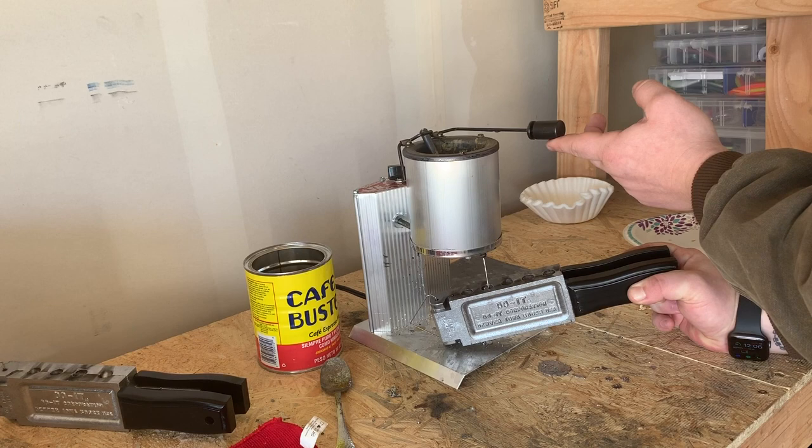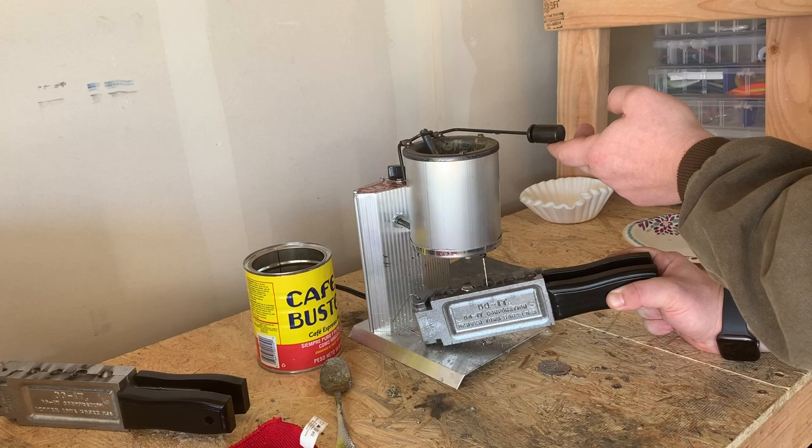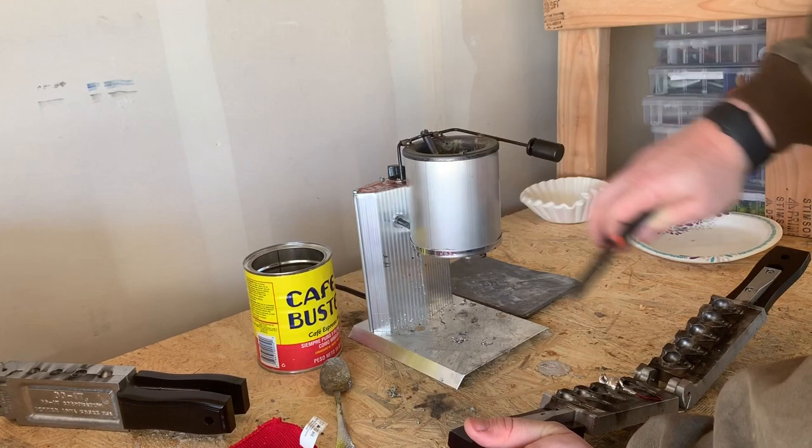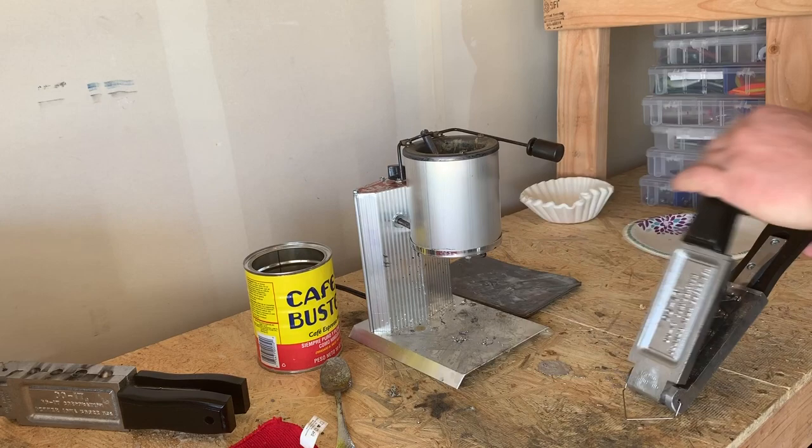Here you can see I tilt this jig mold forward and it's a little further away from the pot. You just have to play around with your jig molds and figure out which is which — some like to be poured facing downward, some facing upward, and you can play around with how far away from the pour spout you are.